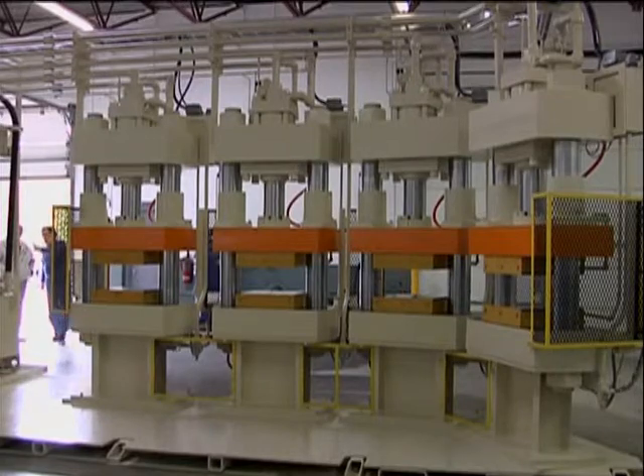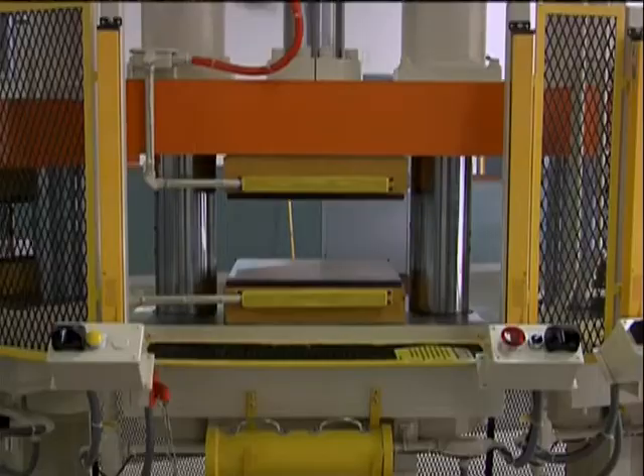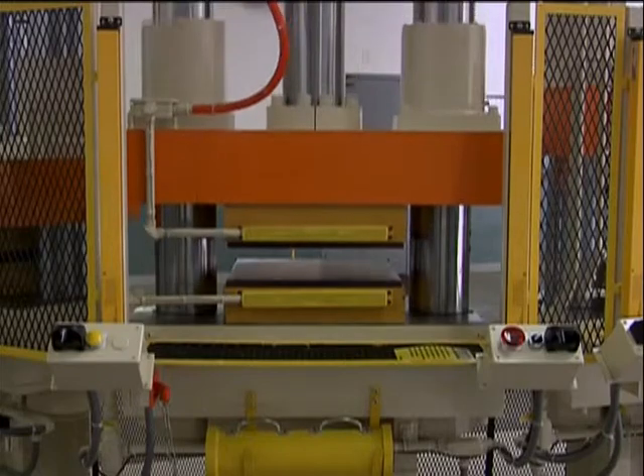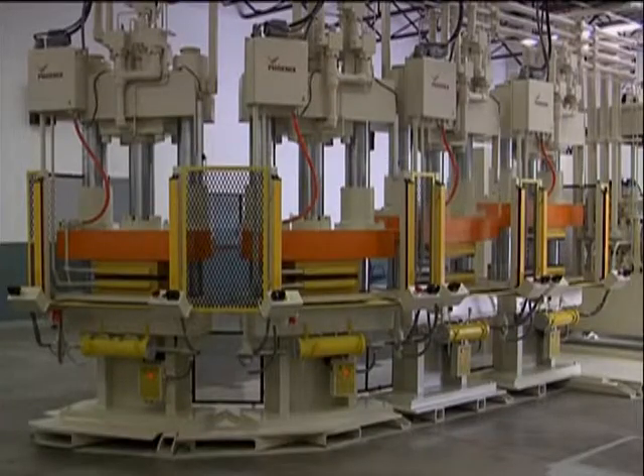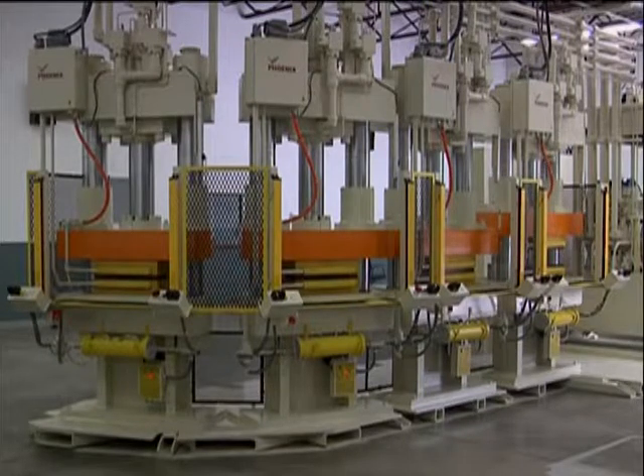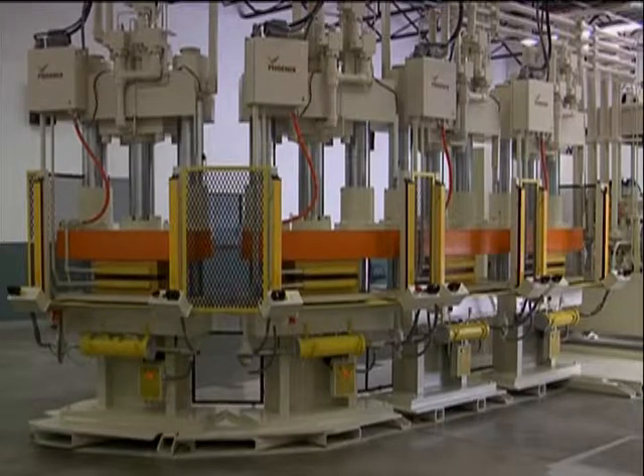The 4-cells each have an 18-inch by 18-inch heated platens with insulation on the bottom and side to protect the press from heat damage, capable of reaching temperatures up to 750 degrees. The cells are designed to build pressure on one press while allowing movement of the next press platen. Platen temperatures are set between 500 degrees to 550 degrees Fahrenheit.